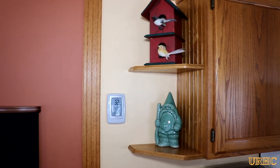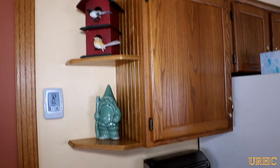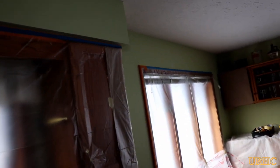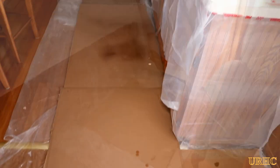You can see the new color really does go well with the color in the living room. It was kind of hard to choose a paint to match granite and then match another color, but I'm really happy with the new color. Moving over to the next area, I got everything taped off again, took everything off the wall, patched all the small holes, and then you have to go back with soap and water and wash down the walls before you put the new paint on. The biggest part of the job is really preparing it.